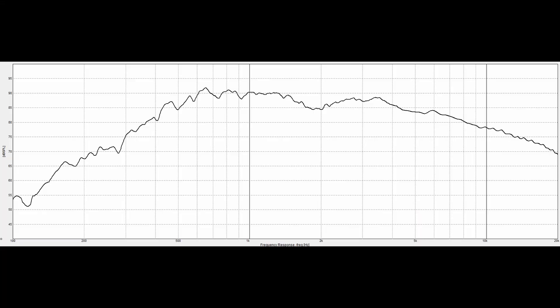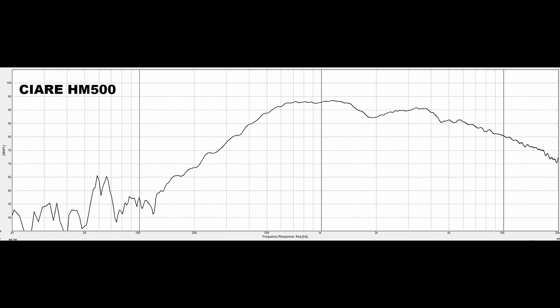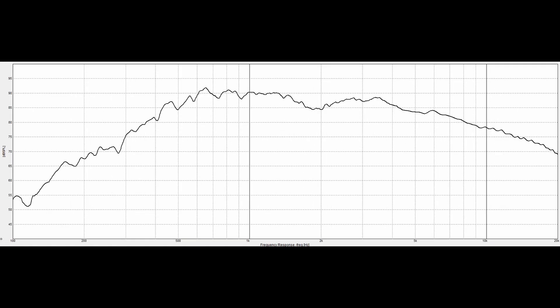Off camera, I took a measurement in the garage like I was showing you there in the intro. And right off the bat, there's a lot of similarity to my old measurements, so things are working. You can see the diffraction happening around 2000 hertz — there's a big dip there. But look at my outdoor measurement from before — look how much smoother it is. The scales are different, so it looks a little bit compressed, but much smoother because I don't have those reflections. Even though I've windowed or gated this measurement in the garage, the outdoor measurements are still a lot cleaner. So let that be a little takeaway from this video if nothing else.